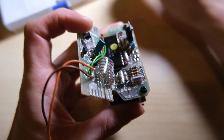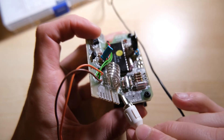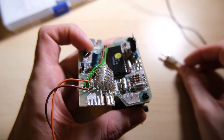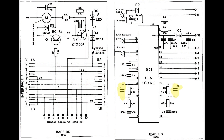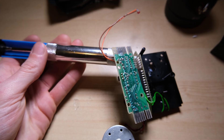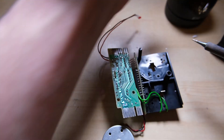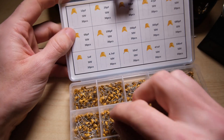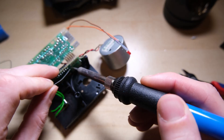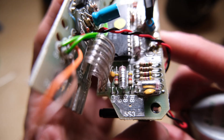What I'm doing here is removing the motor so I can access the back of the board to fit C7 and C9. These generally aren't fitted, but I'm told that they do improve reliability, so I'm going to find a couple of 100pF capacitors and pop them in. Here they are highlighted on the schematic, and here's me fumbling trying to clear the joints. You can see why it was necessary to remove the motor — it would have been impossible to access the underside of the PCB. BluTac comes in useful to keep the thing in place while you're working on it.